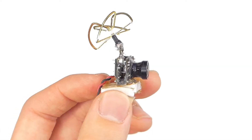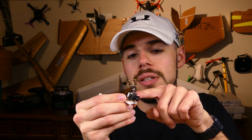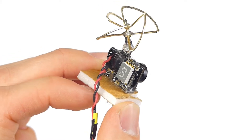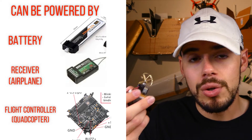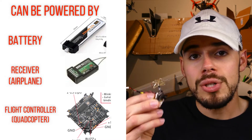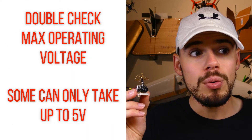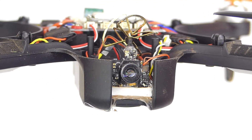The cheapest way to add this to your aircraft is to just get one of these little guys. This is an AKK A1 unit — they call it a 3-in-1 because they're talking about the camera, the video transmitter, and the antenna. This is all you need. You connect this to a power source, which could be its own battery, connected to the main flight battery, or connected to the airplane receiver for a constant 5 volts of power. Be sure to check the manual and make sure you're within the voltage range, otherwise it'll go poof, smoke, and you won't have a video transmitter anymore. You can get a little setup like this for anywhere from $15 to $35 or so.